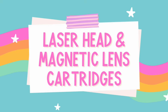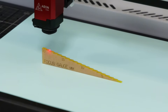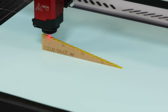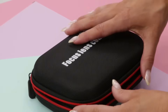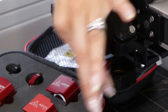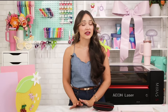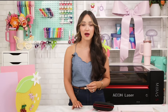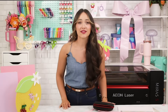The Mira 5S comes pre-installed with a 2-inch lens cartridge, perfect for most general projects. To focus this lens I typically use a gap of 8.5 millimeters between the laser head and the material using Eon's included focus gauge. If you want to upgrade or specialize, Eon makes it super easy with magnetic lens cartridges — no tools required. You just gently pull out the current lens, store it somewhere safe and clean, and snap the new lens into place until it sits flush with the head. Personally I love using the 2.5-inch lens when engraving full tumbler wraps with the rotary attachment, giving me a longer focal length so the head doesn't collide with any curved surfaces. For those projects I manually focus between 10.5 and 21 millimeters depending on the size of my tumbler.